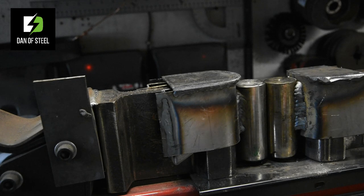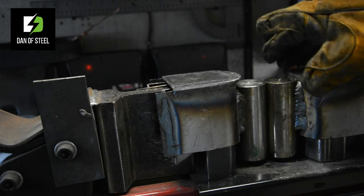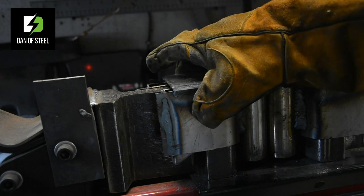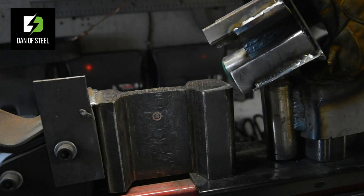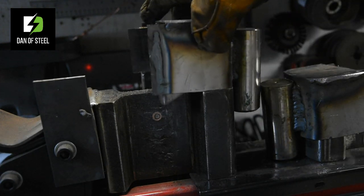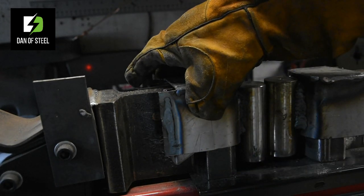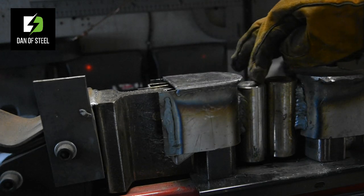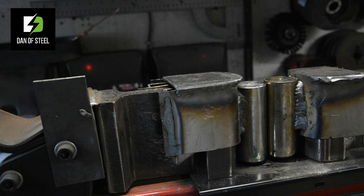Okay, here we are. And what we're looking at now is, you saw the basic fab there, but what I need to do now is make sure that these pieces can't twist when the two round sections come together. So what I'm doing is simply going through my scrap pile, finding what I can, and this will all be cleaned up obviously, but what I've done is taken some scrap steel, cut it so that it fits either side of the back side of the railway there, and simply I should be able to offer these pieces up and drop them into place, which will stop these from twisting. Well, that's the plan anyway. So when the two faces come together, we get a nice even squish. So that's that side roughed in. We'll do this side now, and then we'll give it a little test before we do a full cleanup and make everything nice and pretty.